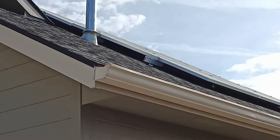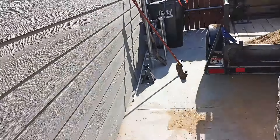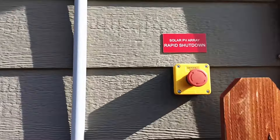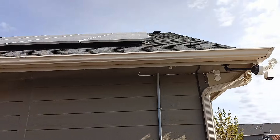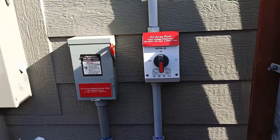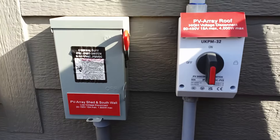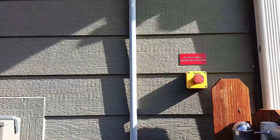That wireless transmitter is turned on or off with the safety button here, which is reachable over the fence for first responders if needed for rapid shutdown. My panels come into the attic down, and here's a glimpse of some of my safety equipment — I have one of these on the shed and one for the roof. Here's how I have them labeled: the feed from the shed comes in, and there's my generator hookup. These are the safety disconnects, and that is the rapid shutdown — if you push that, all the panels will shut off at the panel level.